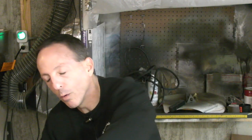And there's other types of filters, like on this particular unit. There's organic vapor or acid gas. There's combinations, alkalines. So you just have to know what you're spraying. Remember one of the two rules: if you can smell it, you're breathing it, right? So one of the ways you know your respirator filter is not working is you smell the contaminant.